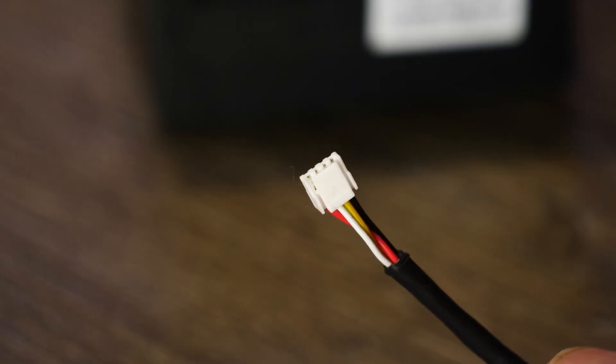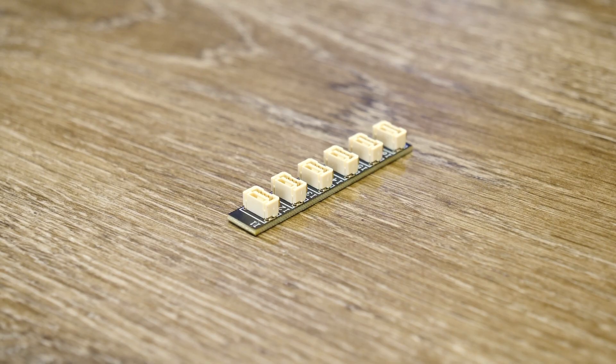Just like the later batches of the HERE 2, the HERE 3 uses CAN bus as standard and is pre-wired from the factory to use the CAN connector on your autopilot - either CAN 1 or CAN 2. On the topic of CAN bus, people ask whether you can use a splitter or adapter to get multiple inputs or outputs. Whilst there are two CAN ports on the Cube autopilot, there are situations where you might want to use two, three or more GPS units or other CAN devices. You can actually use a splitter for CAN - specifically the original I2C splitter that came with your autopilot works for CAN.